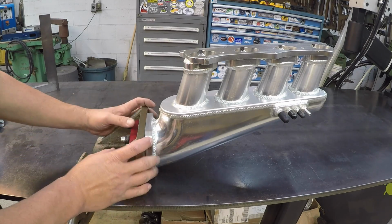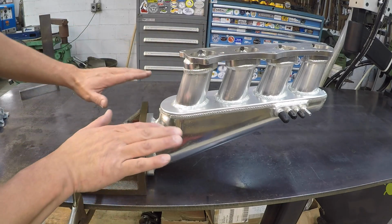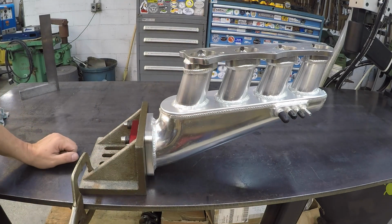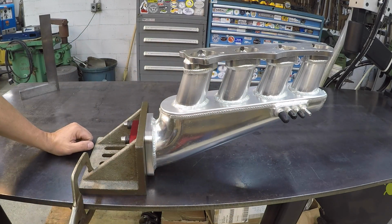So we'll just get it bolted up just like this to the angle plate, and then we'll start tilting the table down to get our flange indicated nice and level, and then get this outer end supported with a machinist jack and a couple toe clamps. So just want to show you that's what the setup's going to look like. So now we can go to the shaper, start getting it ready.